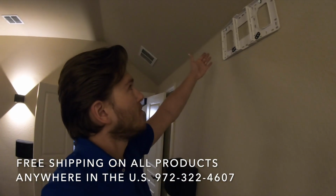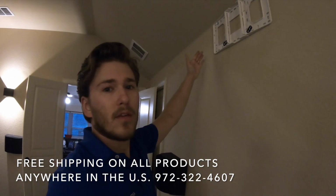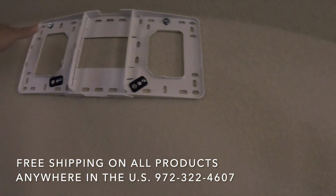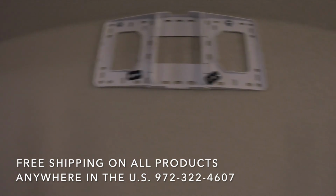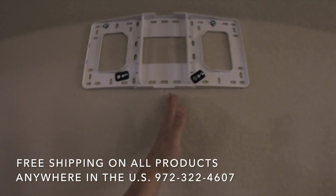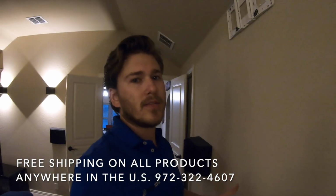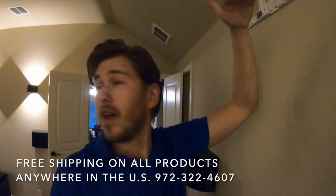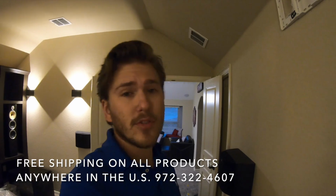You guys can see I got this back bracket securely installed to the wall right here. I'm into the header, so it's plenty of support, but I threw a couple 75 pound anchors in down below as well. There was a stud over here and a stud here, but this is center of the wall, so I definitely needed it to be center, and it needed to be as high as possible, because ideally it would be even higher right at the top of the screen, but we're working with what we have based on the room. So now I'm going to go ahead and get my projector thrown up here.